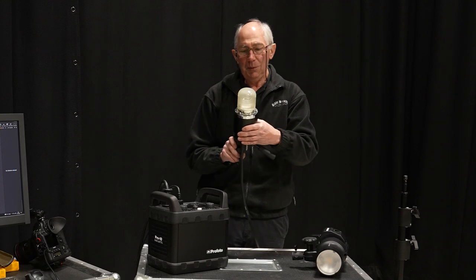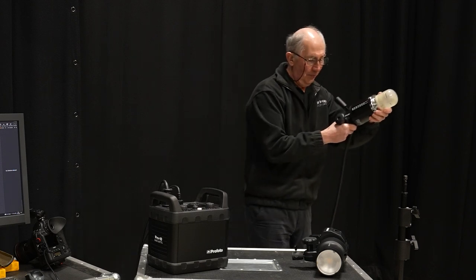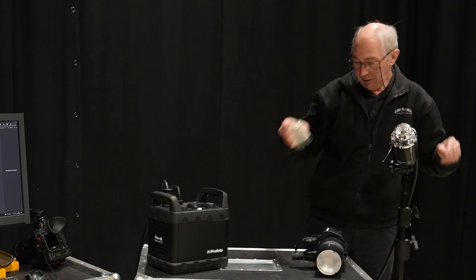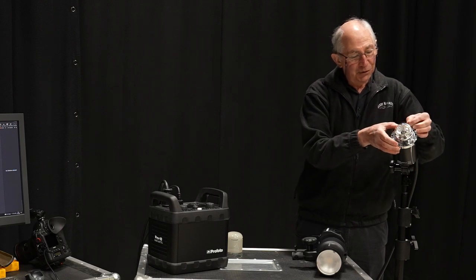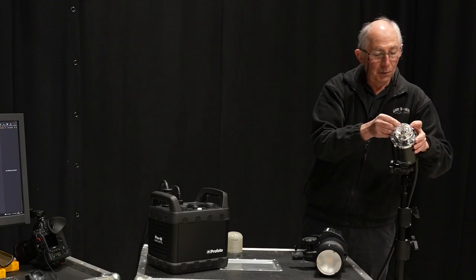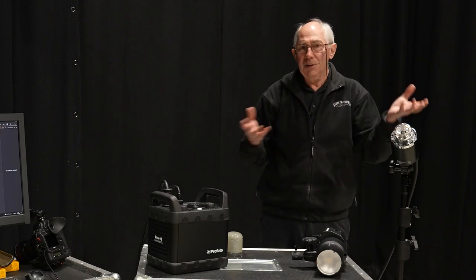In order to see what's going on inside, I'm going to take the glass dome off the top. I'll just pop it on this stand and take the dome off the top. That reveals the flash tube itself around the outside, and in the centre we have a modelling lamp. This particular one is a tungsten halogen modelling lamp, though these days you also get LED versions — but it's the same principle.